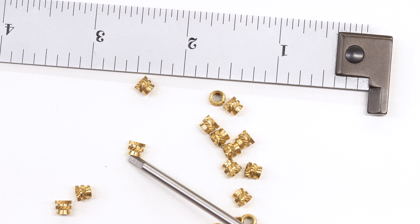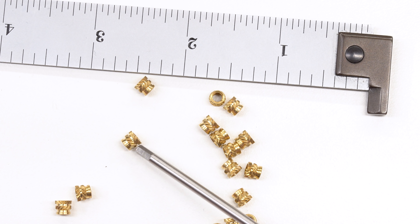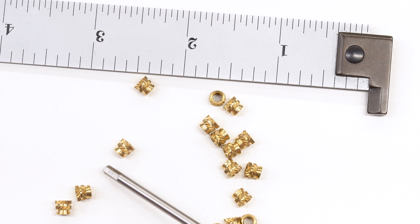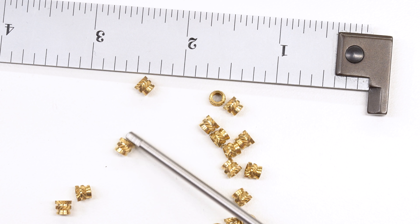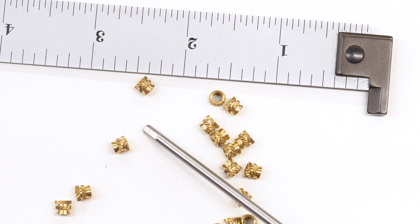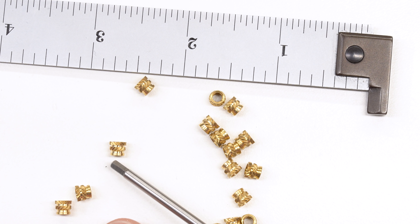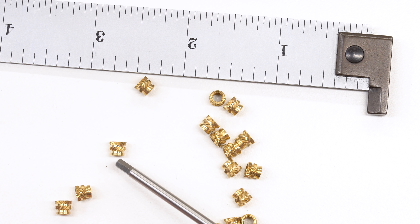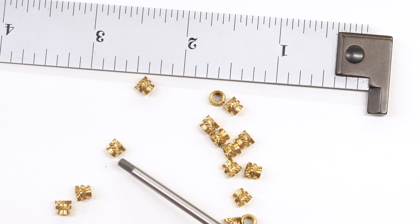These particular inserts are designed to fit into a 4mm hole. If you look around on the web for instructions on how to put in these inserts, you'll find a lot of instructions that say you need to make a tapered hole. While you absolutely can do that — we're 3D printing after all, you can just design that in your CAD software — it is more trouble than it's probably worth. For this particular insert, the narrow end is about 4mm wide. So if I 3D print a hole that's right on 4mm, it will just start to go in, and then I can heat up the insert and press it the rest of the way down.